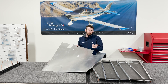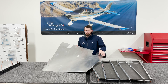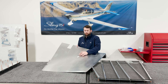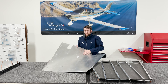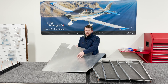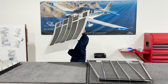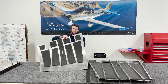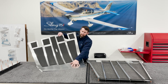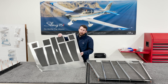It's easier to do this now before the skin is on than afterwards. Most blade-style transponder antennas have two studs that come up through, and you'll need to access the nuts through the top to secure it. Always remember: if you cut out a little bit of material, keep your edges rounded so there are no stress points to cause a rip or tear, and keep the hole as small as you can. Stop your insulation before the rudder pedal rivet area — there are so many rivets up there that it's better to leave the insulation off from that area.